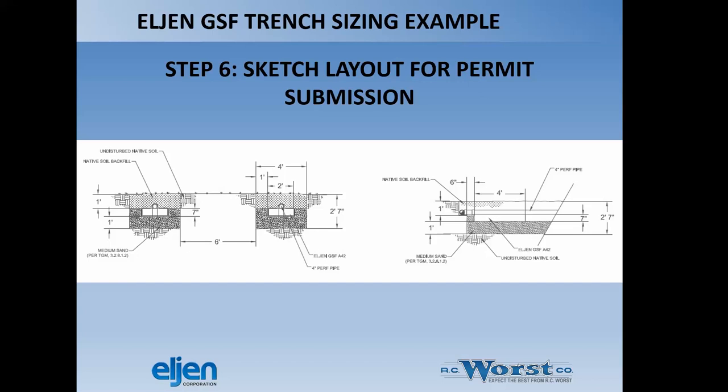This is a below grade system. You got a foot of cover over it. There is no need for venting. Now the foot of cover, just so you understand, is from the top of the Eljen unit, not from the top of the pipe, the perf pipe or fabric. So you gain a little bit there because you can measure that 1 foot from the top of the Eljen unit itself.